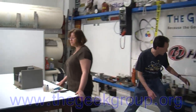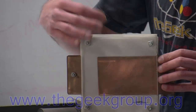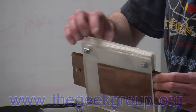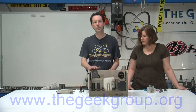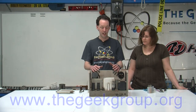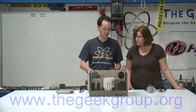Here's our other capacitor — there's two sets of plates. You've got this side stack over here, and you've got this side stack over here, and they're interwoven with an insulator in between them — we call that a dielectric. Here you've got copper plates with a plastic dielectric, and over on the air variable you've got metal plates with air as the dielectric. As you move them in and out, the value of the capacitor changes. A capacitor is like a battery where it charges and discharges very, very quickly. The more the capacitors are together, the lower the frequency of the oscillator circuit — this whole thing is pretty much just a very precise variable oscillator.